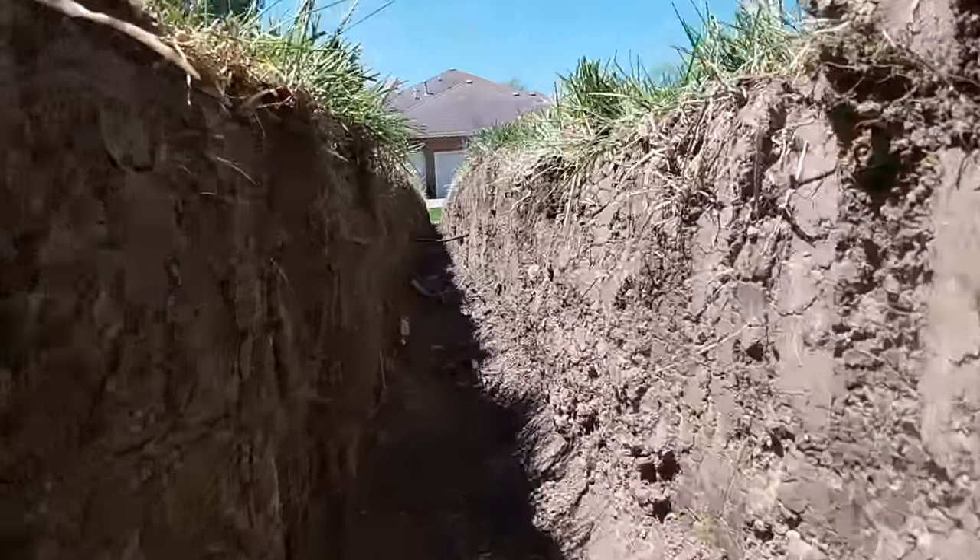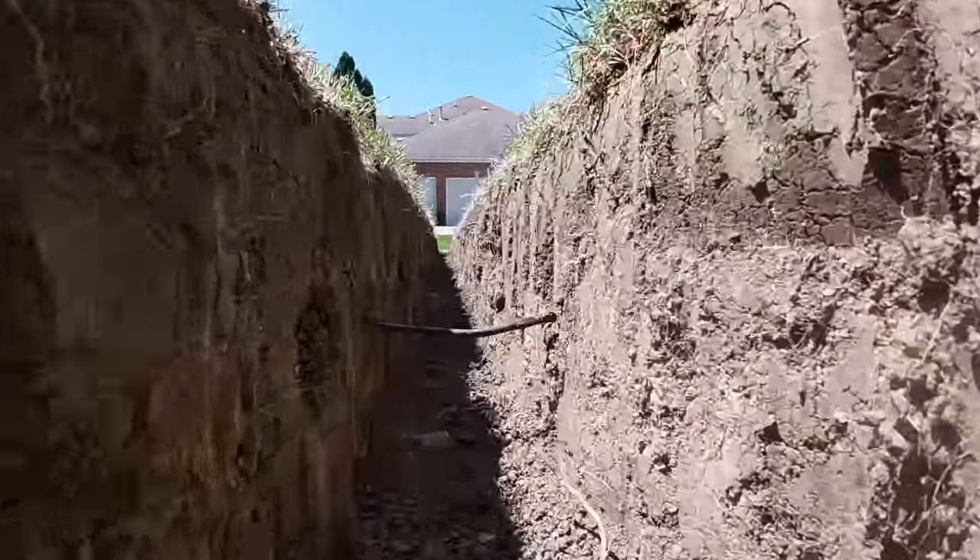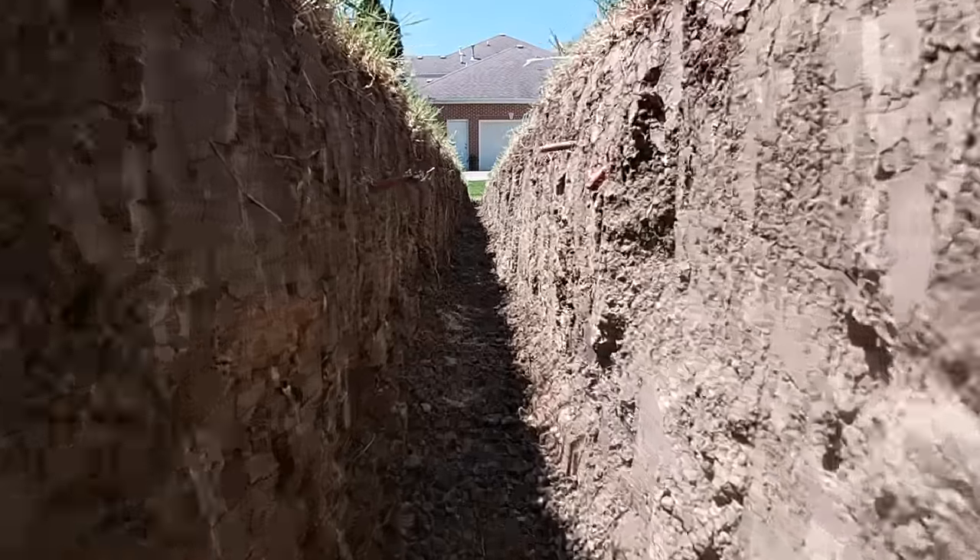Specifically, I'll be using a solid single-walled corrugated pipe at four inches in diameter. I'm going with corrugated because I'm only going to have about eight to twelve inches of soil on top of this pipe, which is well above the freeze line in my area. There's going to be some expansion and contraction of the ground, so I want the pipe to have some flexibility and not fail or crack over time.